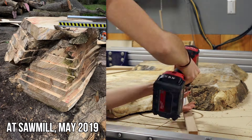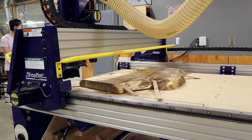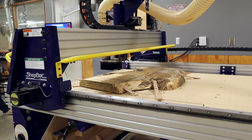I've got this big rough cut slab I bought right off the sawmill. Step one is surfacing it, which basically means we need to make the flat faces actually flat. This is the first time I'm using a slab that doesn't fit in a planer, but luckily I have access to a ShopBot PRS Alpha CNC machine, so I'll be using the surfacing function on that. You may have seen this done with a router and a jig — this is the exact same idea, just using computers.